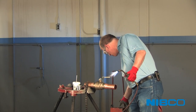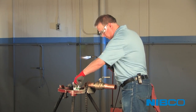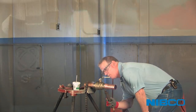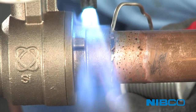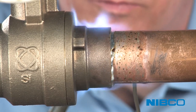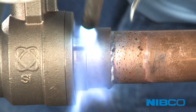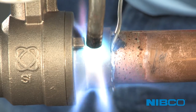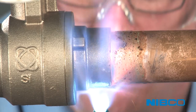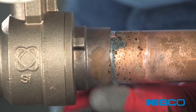Silicon bronze alloys will transfer heat away from the joint more slowly than copper or leaded bronze. Therefore, more attention must be required to achieve uniform heating of the alloy. Heating fuel and torch tip selection will determine the amount of heat being delivered and therefore affect the time it takes to achieve a satisfactory solder joint. Solder, flux, and lead-free alloy combinations should always be tested with the preferred heat source according to the installer's techniques.